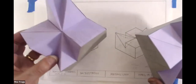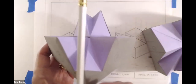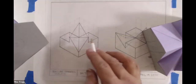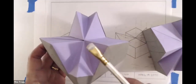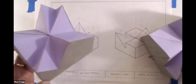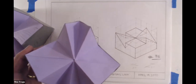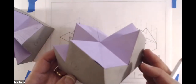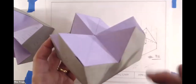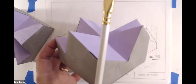And the two views we're gonna do is one view where when you look at the cube, it's gonna be perfectly symmetrical, left to right, okay? So it's gonna be a mirror image. And you'll see that with isometric views like this, some lines will become kind of not so much three-dimensional anymore. So sometimes it might look funny, but never mind. The other view on the right side is gonna be turned 90 degrees. So that now we have a view that's actually asymmetrical. So if I split this view down the middle, the right side is gonna be different looking than the left side, okay?